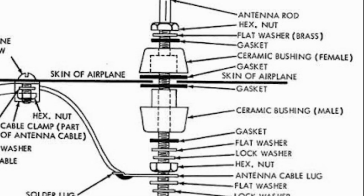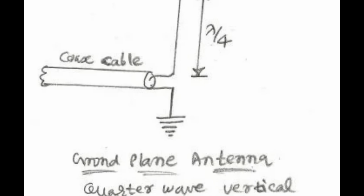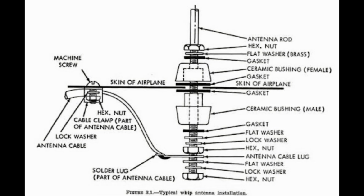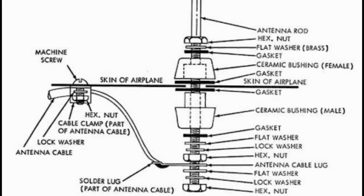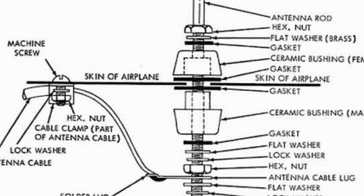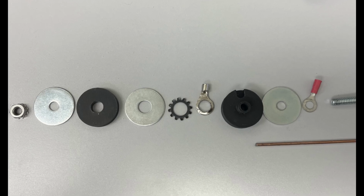Again, for us that have a 4130 fuselage, why can't we use our fuse as our ground plane and attach the same quarter wave antenna out the top? So, with 3D printing at my fingertips, I began to draw a simple isolator to easily isolate the fuse from the antenna bolt whisker. From my research of the old antennas, they didn't come with any BNC connector at the antenna base, so I thought that'd be an extra bonus for us builders in expense and especially weight savings. So let's build one and see what y'all think.